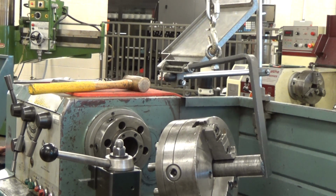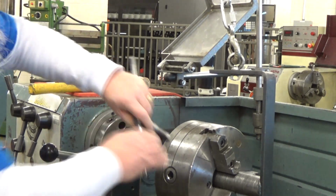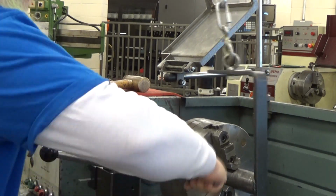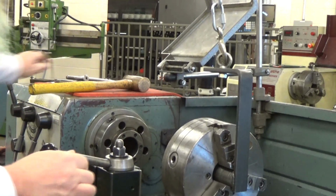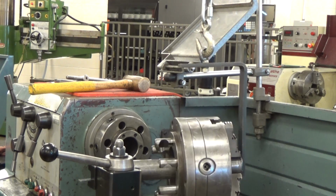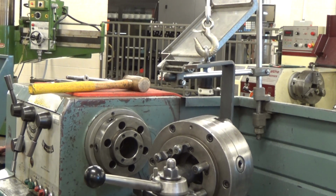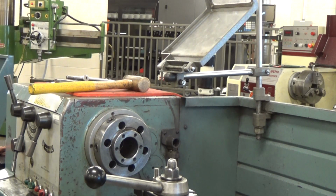So I'm going to loosen the hoist so it drops down, and then we will take the chuck key, loosen it, slide that in, tighten it back just snug, because you're going to want to take it out of there once you get the chuck on the floor. And now when we lift it up, it's staying nice and balanced. It's setting level. It isn't dipping like that was previously. So something to keep in mind when you're doing that. I want to make sure you guys are aware of that.